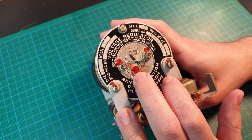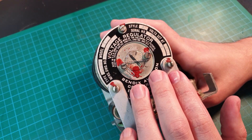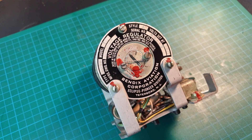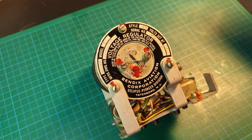If you're wondering about these lock wires, technicians use a special tool called lock wire pliers. The pliers clamp onto the wire and with this piece in the middle of the shaft, you pull that and the pliers lock onto the wire. Then you pull the knob at the end which rotates the pliers and the wire together, making your lock wire.